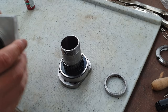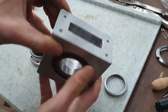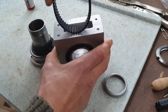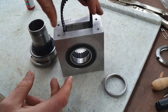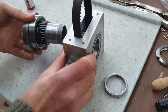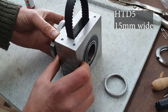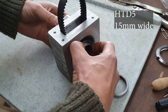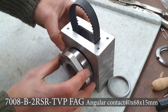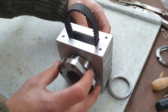I'll show you how the rotating ball nut mounting system goes together. It's just a bit of cast aluminium I melted ages ago. The shaft that goes onto the belt is just a pipe welded to a flange with the pulley mounted on it. It connects to a toothed HTD 5 pitched belt. The angular contact bearings are arranged in an opposing way so they tighten against each other.